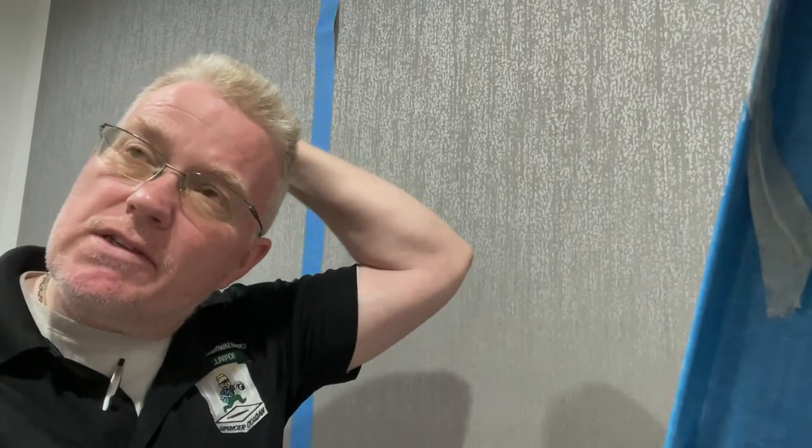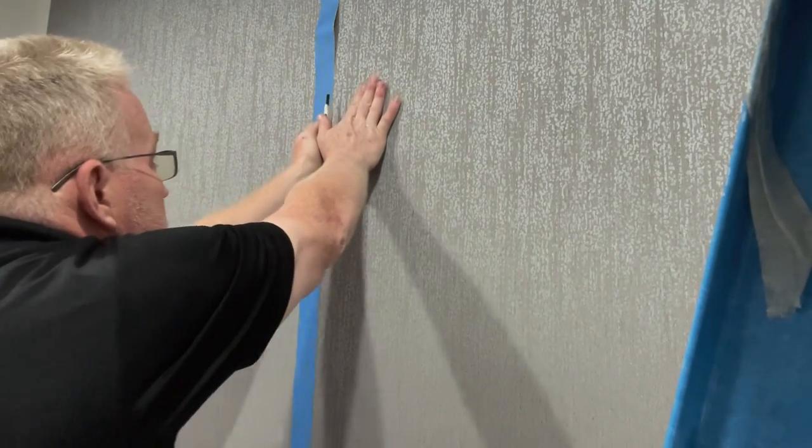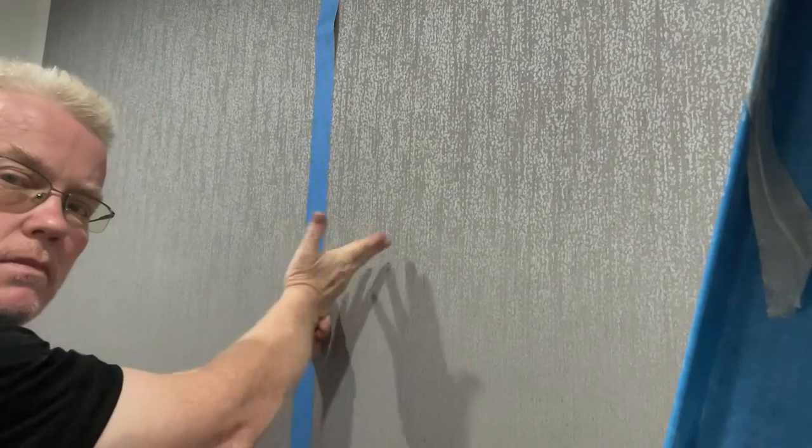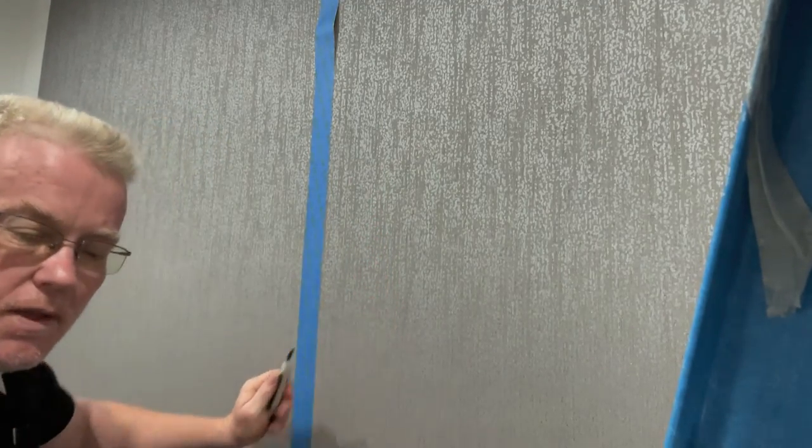If you look at my Instagram channel, I recently featured a commercial establishment in Texas and one in California — fast food places. I saw that this is what people are doing. They're using their hand. When they get to the bottom, the body changes — you're kneeling down like a catcher — and you tend to start doing that, following the curve. Here's why: as the air has dirt in it — look at your air conditioner filters, it's all dirt — that dirt gets on the wallpaper. The wallpaper gets cleaned and the dirt gets trapped in the seam. After time, you will see the cut goes like this because it doesn't stay clean. So if you want to do it better, use this technique.